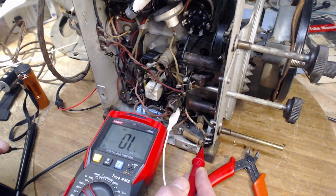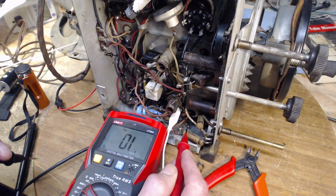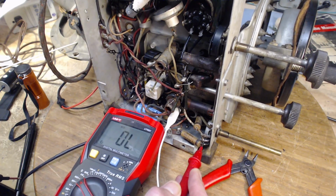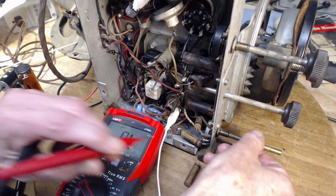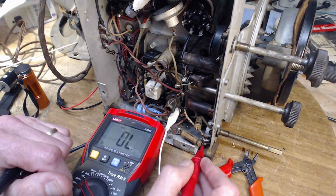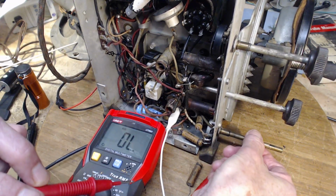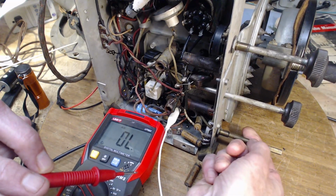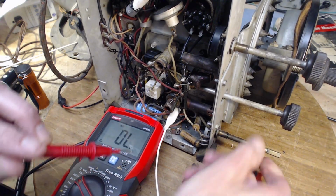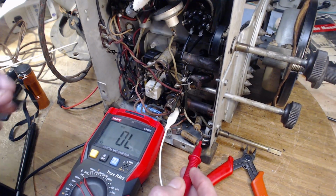That makes this the input side. And this capacitor is carrying the input signal into the volume control. And that would mean minimum volume is maximum resistance between here and here, which would set this the way I just set it. And this would be a short circuit. Top volume, it all makes sense. It's all making sense, except how does this get a ground?